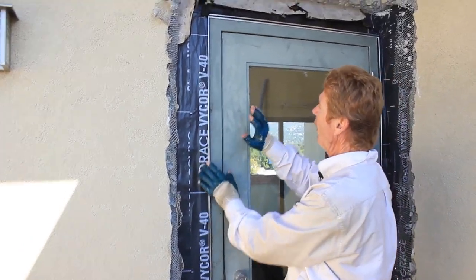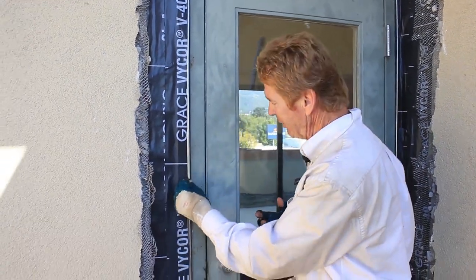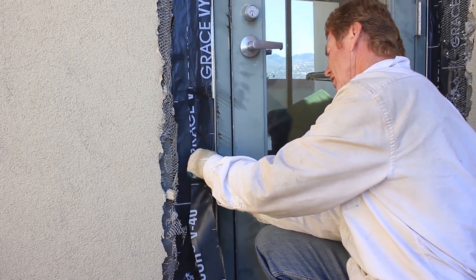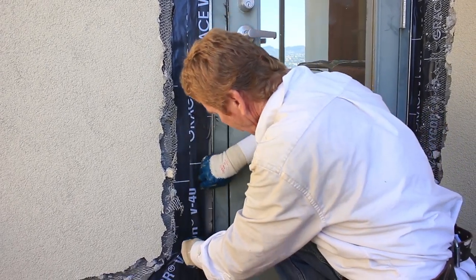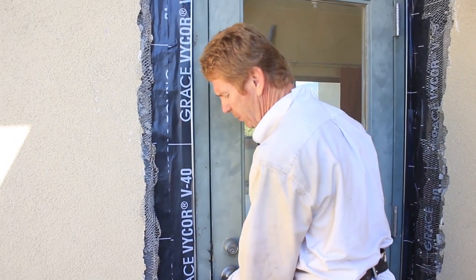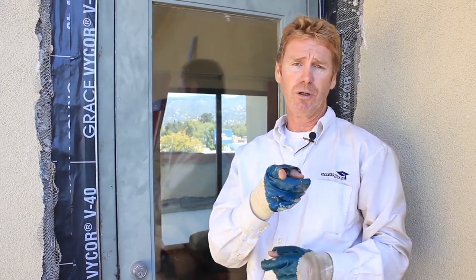We are at the stage where our J trim is on as best as possible, due to all the imperfections in all these different metals. We graced under here, we papered over it, and this J trim is more of an expansion joint. The fellow says you don't need to put that Grace product over the flange, and I told him — you guys have already been through this issue and this is a second time around, so we want to overkill. Do it way better than what it calls for. This may be considered overkill, but it's the second time around and it's in litigation, so we do everything beyond what even the specifications call for. This way everything is sealed under here, sealed on top, the door is sealed — everything is proper. My name is Kirk, I'm with Kirk Giordano plastering, we thank you for watching, and as usual see you guys on the next one.